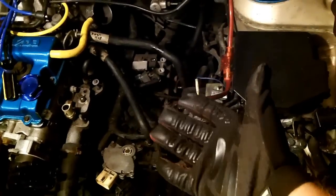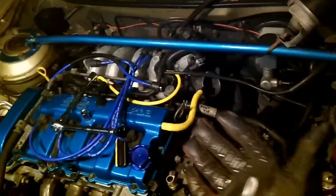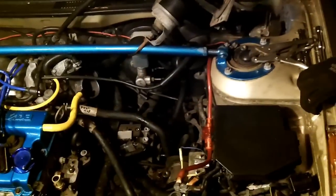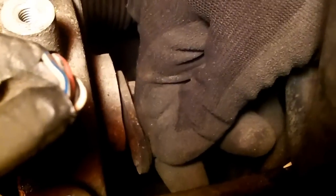If you're going to lift up the harness or take the transmission out from the top, you have to disconnect all the harness including the fuse box and everything connected to it. You might be able to just fold it over and sit it on top of the engine as you lift the transmission out. Make sure you label everything — we know where everything goes back, but make sure you label everything. Andy found the point where the shifter cable attaches to the transmission.